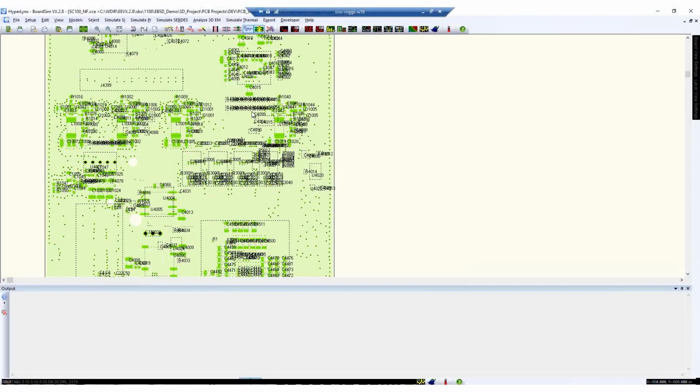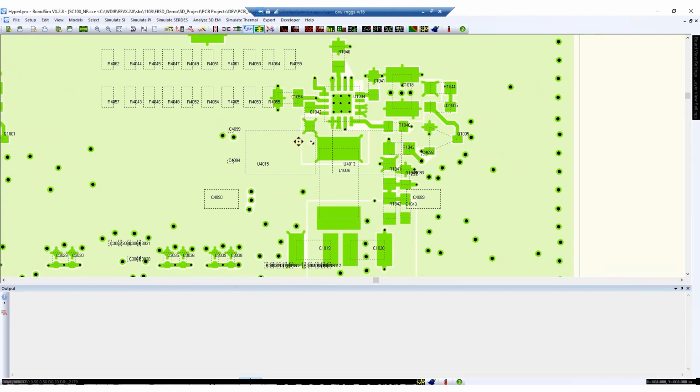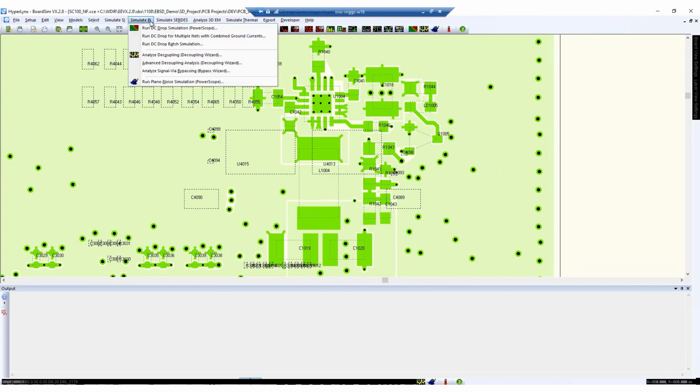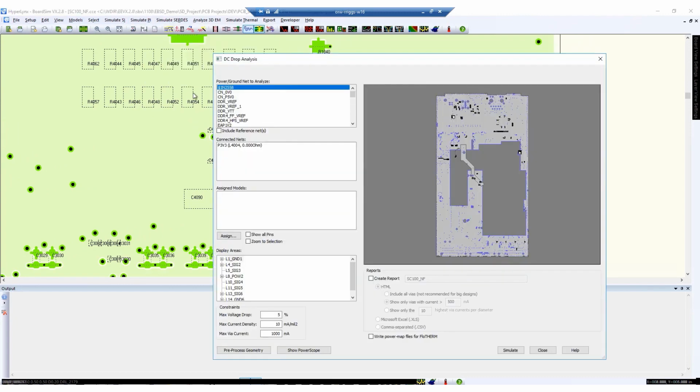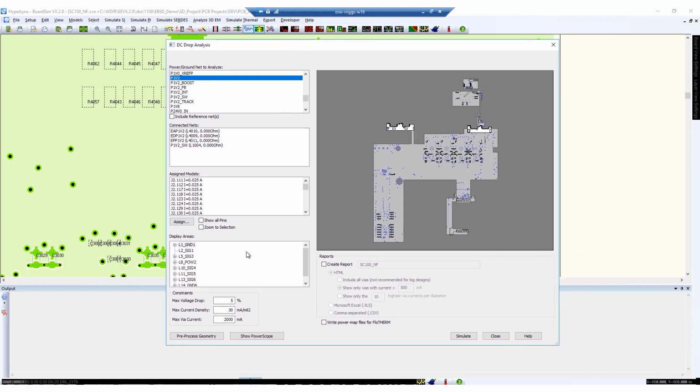Hi there, Rory again, here to do a final electrical sign-off for power integrity with HyperLynx. We will do a DC drop simulation on the entire design, now that it is complete, to make sure that there aren't any new power problems, and to verify everything is in order before fabrication. Remember, we had a failure before on the PE1v2 plane where we exceeded our max current density.